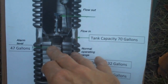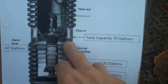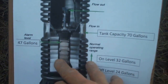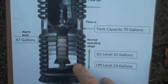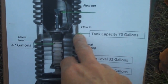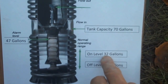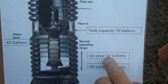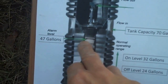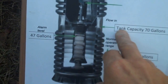Jan's bathtub wouldn't hold more than 25 gallons anyway, so that's actually pretty good. In the event of a power outage, if your pump is obviously not running, you can go up to 70 gallons before you'd have a backup. That's going to give you 38 gallons before you reach that point. If you have a remote sentry alarm, you'll have an alarm that will go off at 47 gallons, giving you another 23 gallons after that alarm goes off.